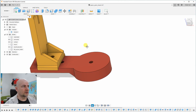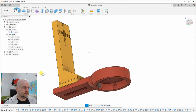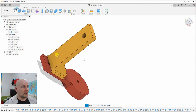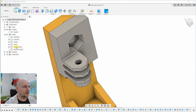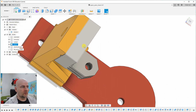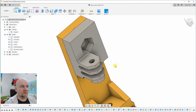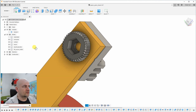Then here goes the vertical holder. Since there are different sizes of the mount on the GoPro, this has to be adjustable — it can move in this direction and be attached together with an M5 screw. There is also a hole for an M8 screw, and there are some channels here for the GoPro mount extensions, so when I rotate this I can position it exactly at 90 degrees to create zenith or nadir images.